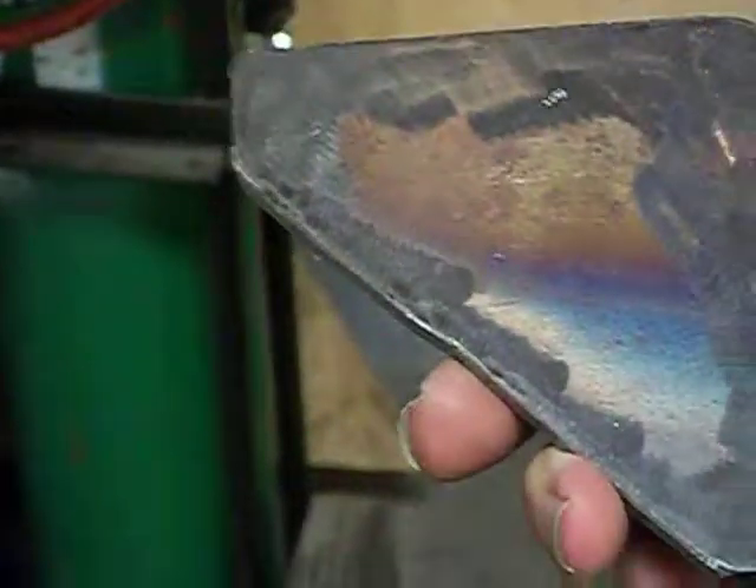I just figured I'd show you what the afterthoughts were about it. What I'm building uses some 2x3 rectangular tubing here, as you can see right down there. I also cut out some gussets with the oxy-acetylene torch — it came out looking pretty good. That'll be the gussets for it. You can see I put a chamfer on this end here, and I didn't cut them all the way up to a sharp triangle because there's no real point — it doesn't really add that much strength. And when you're welding that sharp of a corner, you can always get a chance to burn it back. That's all I've got going on for right now, but I'll keep you updated as the trailer keeps going along. I'll talk to you later.